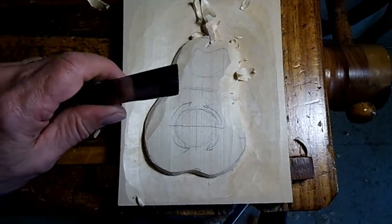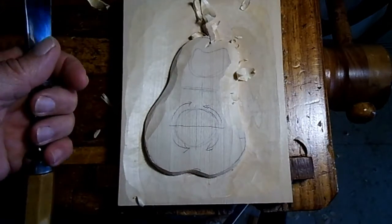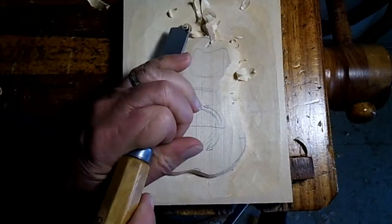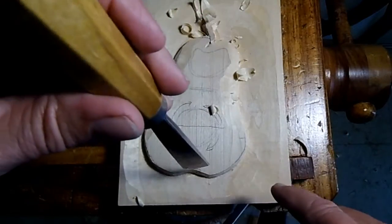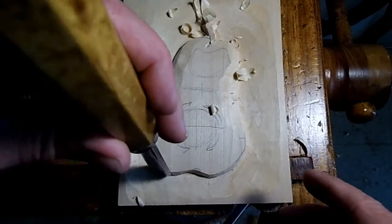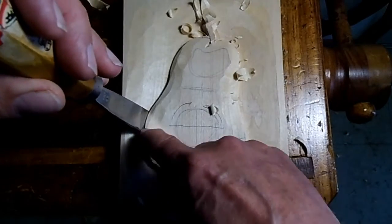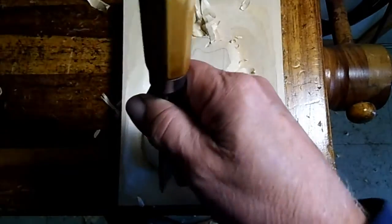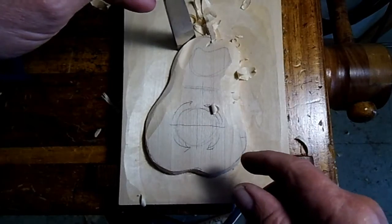Now this gouge has got a little bit of a radius to it, and you can use a gouge in 3 directions. This is the direction that you normally use it. You can use it to plunge cut. So let's say we were going to make our stop cuts instead of with a V-tool. We would come and we would plunge cut with this down. Well, then you would match the radius to the curve. So as we would get into a tighter radius up here, then I would get a different sweep that would match that. So that's the second way of using the tool.